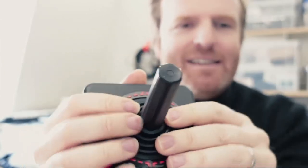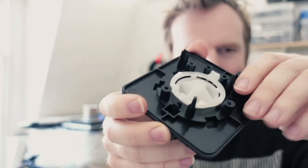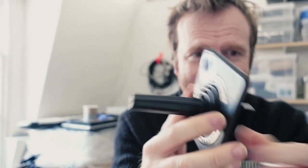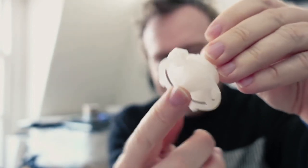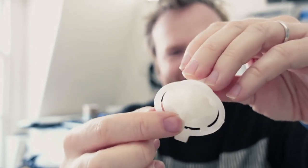But before I go into how I made it wireless, let's have a look at how these are built. You've obviously got this very classic rubber membrane on the top, but inside there's one here — this is what it's like inside. There's the fire button — let's just get rid of that or it'll fly out all over the place. You can see there's this central plastic strengthened piece. This is just like a hollow rubber and this is what gives it its rigidity inside. In the bottom there's a little detent, a little hollow, and that sits on a pointy thing in the base. Then around the edge there are these little knobs that push the actual buttons.